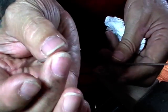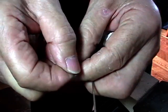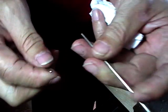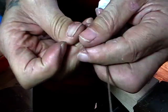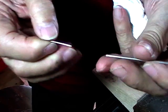This is one millimeter wire that we're using. If you cut your wire with side cutters, what it does is squeeze it into a bit of an oval. So if you check your wire — you know it's one mil, you know that's one mil — and it doesn't fit, file that back into a small point just to get rid of that oval bit.